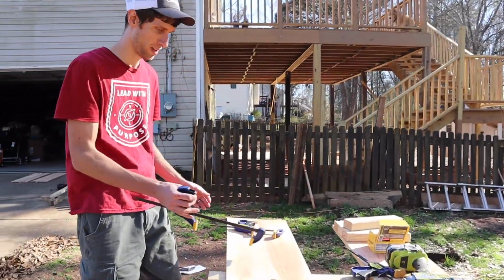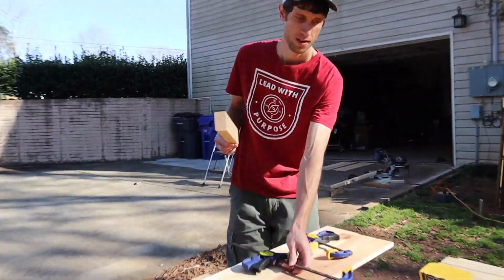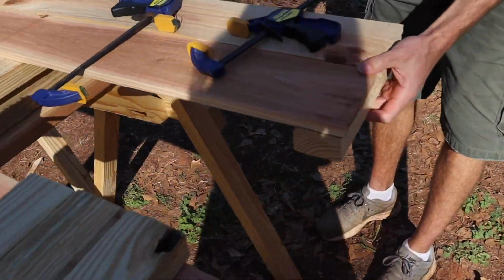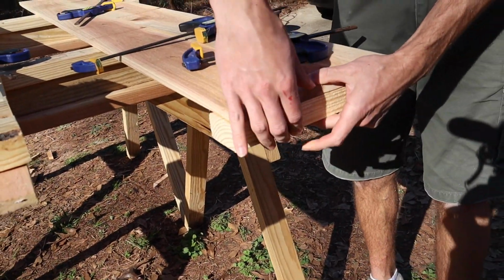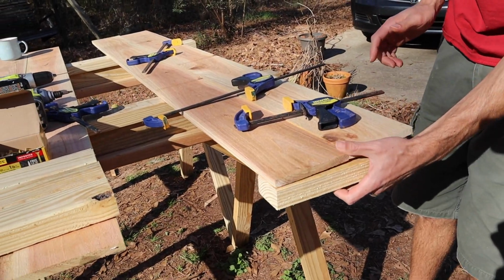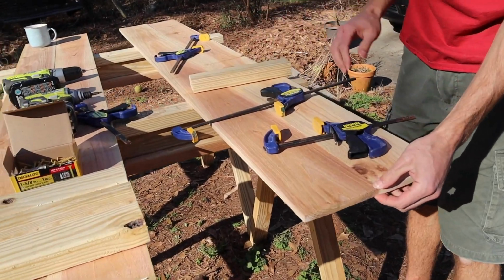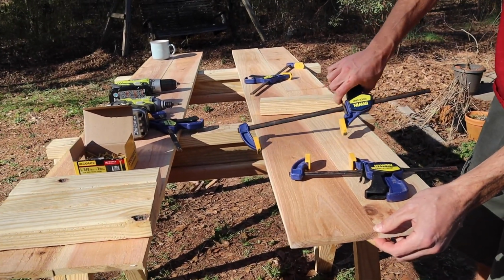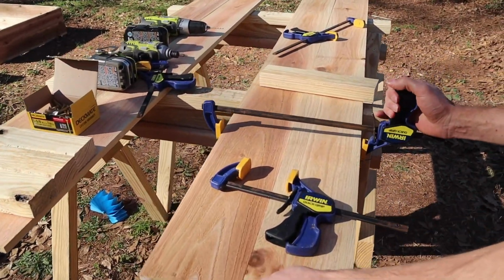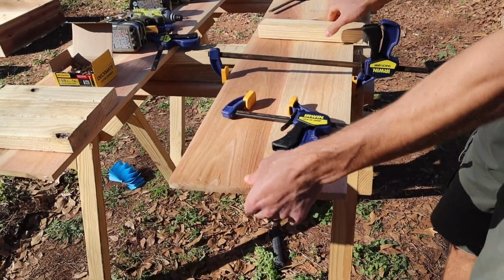So what we're gonna do is take the 2 long ends, and these are our corner braces. We are going to pre-assemble them this way right here. That way we'll come in later and put the other shorter piece right here once these are already screwed in. So to do that, make sure our ends are lined up, make sure the boards are all flush, and what I've been doing is clamping these together. So if you have a long enough clamp, if not, just have a friend hold it for you. Give those a good squeeze together, that way they don't move on you.